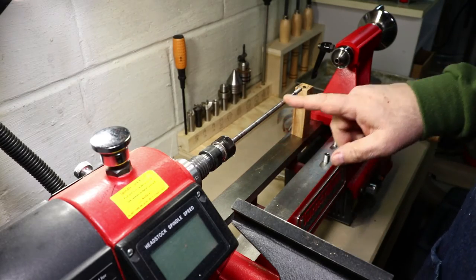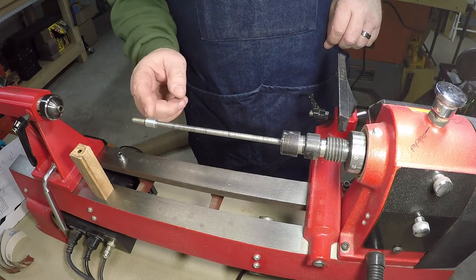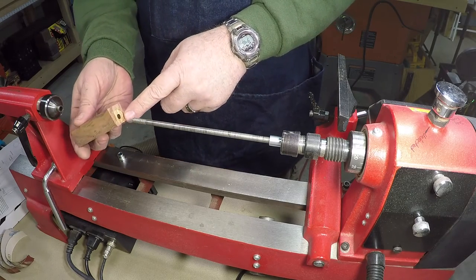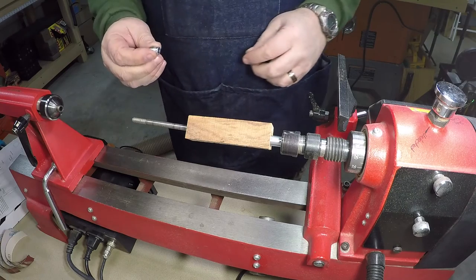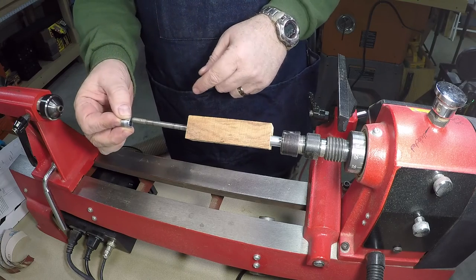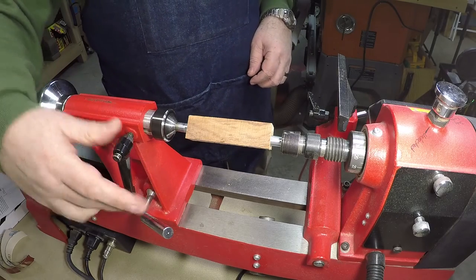What I have mounted here is my 7mm pen mandrel. The bushings for turning this bell handle require the PK Mont BU bushings. I use the upper bushing first, which is the larger of the three, then put the body on. The one that's off-center I'm putting on first because that's going to be my narrowest end, and the better-centered one will be the wider end of my handle. Then the center bushing goes on — it has a slight step, and the larger size step goes towards the end of the workpiece. Then I bring up my tail stock, tighten that down to the bed, tighten the quill just a little bit, and I'm ready to start.